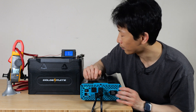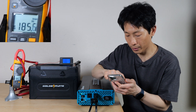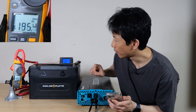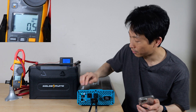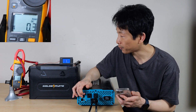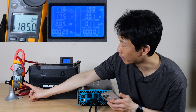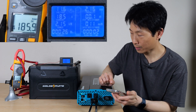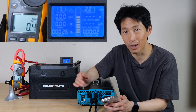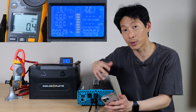Let's turn it on — 29 amps so far. I'm going to increase the load. We're at 170 amps. Let's increase it further. 200 amps. A few seconds and it turned off. So I'm going to turn this off and do that again — 34, 60 amps, 90 amps, 180, 186. It seems like you cannot reach 200 amps for that long, but this does prove that if you go over for a certain amount of time, it will cut itself off, which is a safety feature. Maximum continuous discharge is 100 amps, so it can sustain 100 amps the entire time until the whole thing is drained.